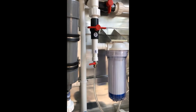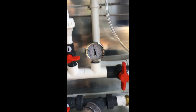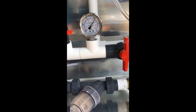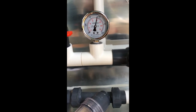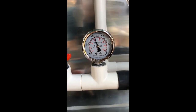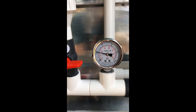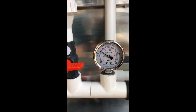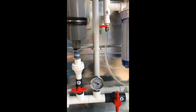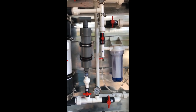After 10 minutes, we open valve number 3 and close valve number 1, which starts filtration mode. The pressure gauge has moved up to 15 to 20 PSI, so we wind down the gate valve until our pressure is at the desired level of 10 PSI. From there we move on to the chlorination stage, which will be presented in Video G.